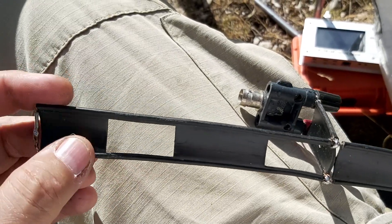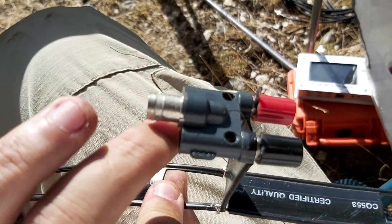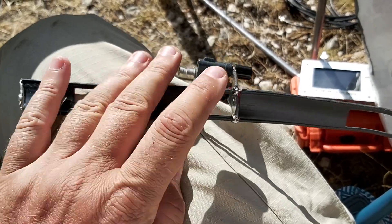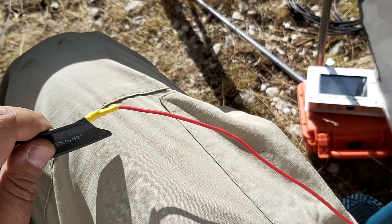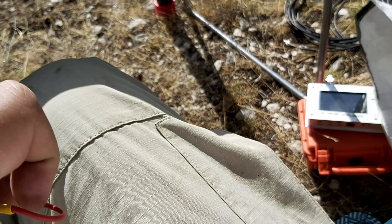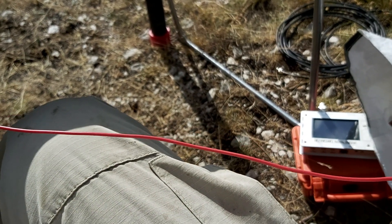Here it's a short circuit, and I think it's about 14 centimeters — you'd have to check the calculator and use it for the frequency you want. I have a BNC adapter here with a short length of ladder line for the matching; this point here should be 50 ohms. Then I have a quarter wavelength of ladder line, and on top of that a half wavelength of wire on six meters — about 2.8 meters of wire. I'm going to hang it up, do a scan, and see if the frequency is spot on and if the antenna is resonant.